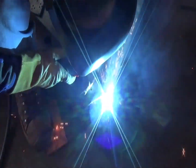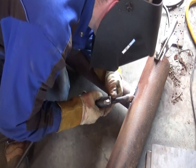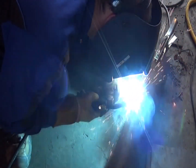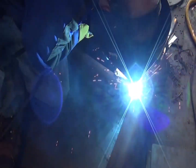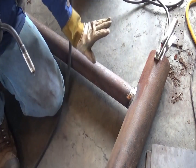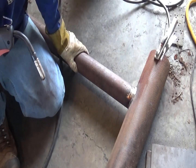That's looking good right there. The top piece — I cut a saddle joint in it, butted it up against the vertical member, and I just welded it in. Now I can go ahead and lay out for the diagonal reinforcing piece.